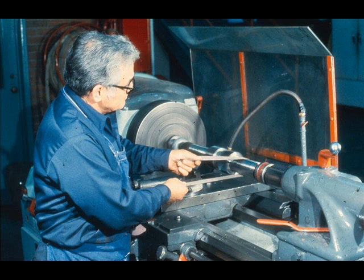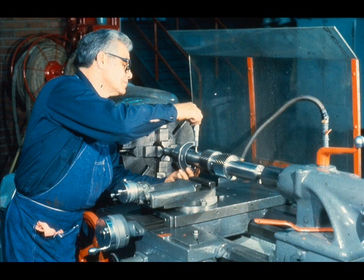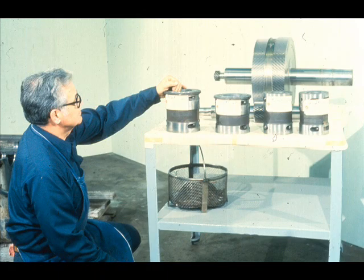Do not remove enough metal to change the clearances. After polishing and inspecting the shaft, mount a dial indicator on the lathe and use it to check the rotating assembly for straightness. The final step is to mic each of the bearing fits to see if they are worn bad enough to require repair or replacement. Complete any repairs which are required, and obtain replacement parts as necessary.